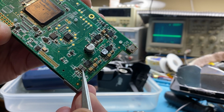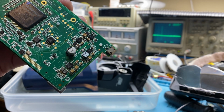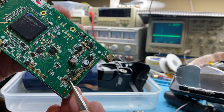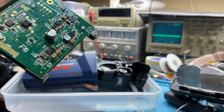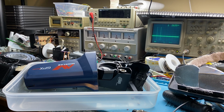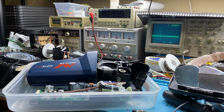Okay, there's an inductor there and an inductor there, and there were other ones there. That and that have been replaced. The other inductors, I have a feeling, these are the replaced ones, by the way. I have a feeling they were wound on a core and very lightly lacquered, painted over by the coil manufacturer. And what that has done is made the winding susceptible to any type of vibration. And the speaker being where it is, the back pressure out of the speaker has jiggled the windings, probably through the board.